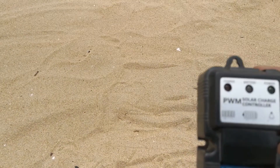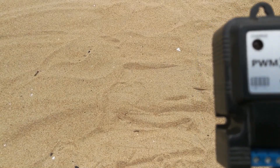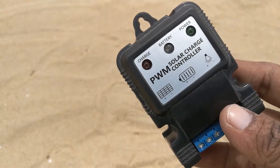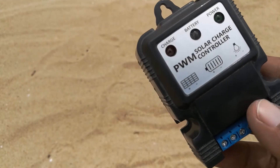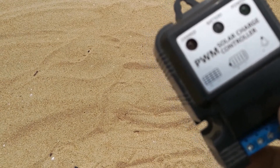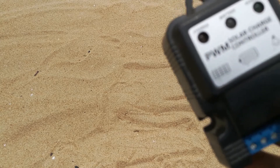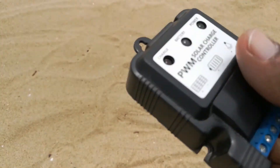The purpose of this device is that you can directly charge your phone with your solar panel. There are small size panels which are 4.5V with about 1W, and you can just use those to charge your device. But when you go for something a little greater, the voltage may not be stable and it can range up to 9, 10, or even 12 volts — even if the panel you're using is just a 6V panel.